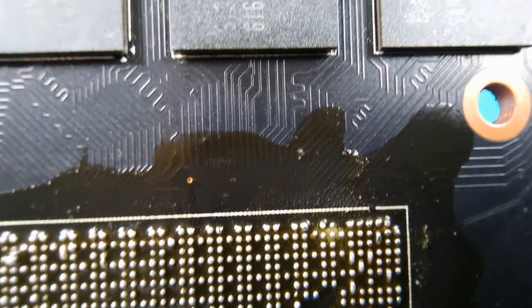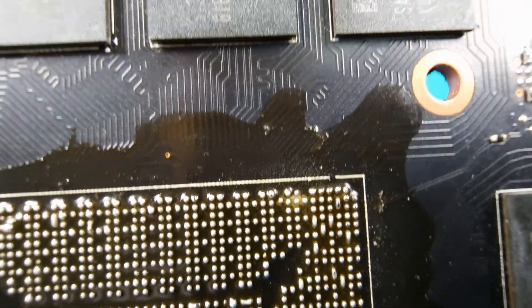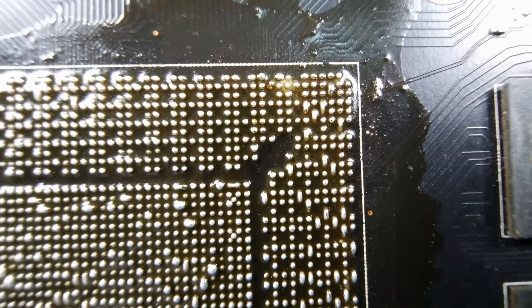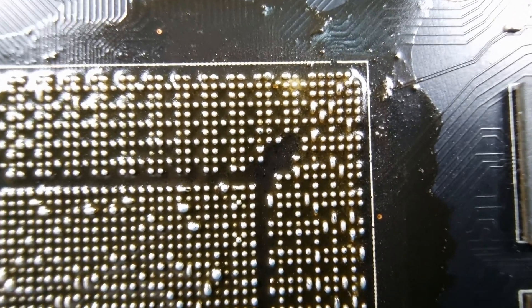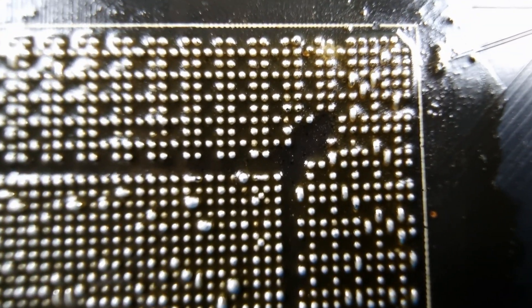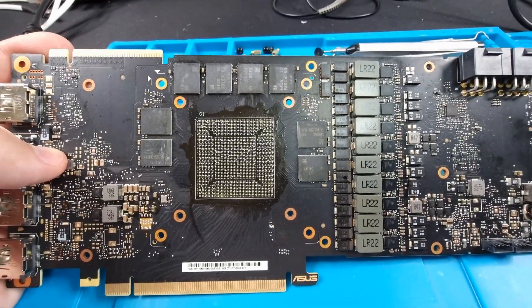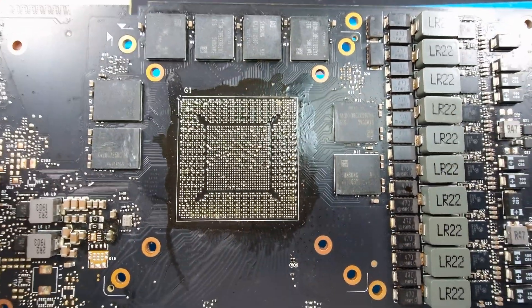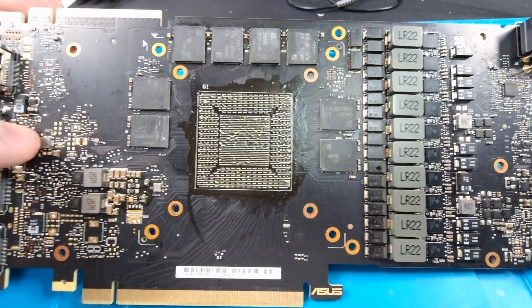If for example here in the middle of the screen they're disconnected, cracked, or ripped, this chip might be throwing errors. But if you pull up the core and notice you can fix the pad — rebuild it, put a new pad on there — when you put your new core on there it will make connection. That's why experienced graphics card repair and BGA rework people do a reball, not a reflow, because a reflow is just a band-aid and eventually the problem will come back.